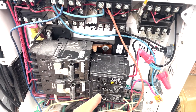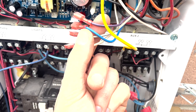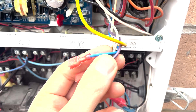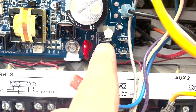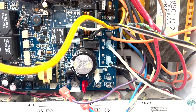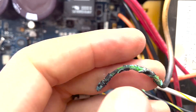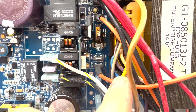Begin by making sure the circuits are all off — you don't want any power coming through this thing. Unplug these four wires: white, gray, blue, and purple. They'll plug in right down here. What I like to do is always take a picture of how they're plugged in beforehand for easy reference. You can see white, gray, blue, and then violet right there. Then this yellow wire goes to the port right there where it says yellow EP1-3, and then this other yellow wire — which is the melted one — goes to EP6 right in there. You can see the yellow terminal as well.